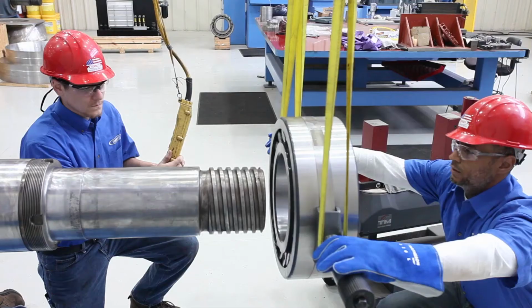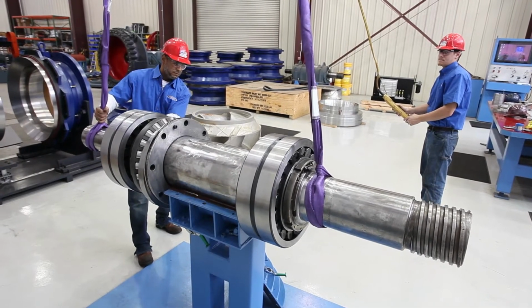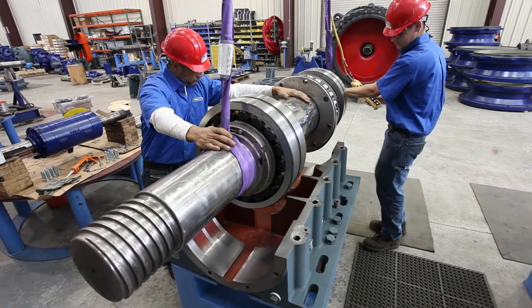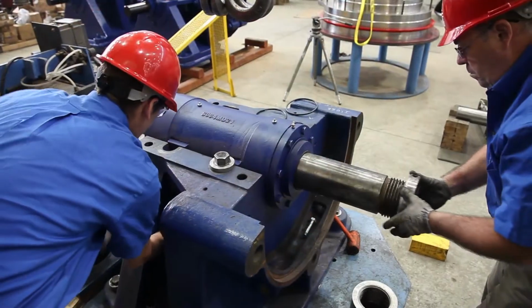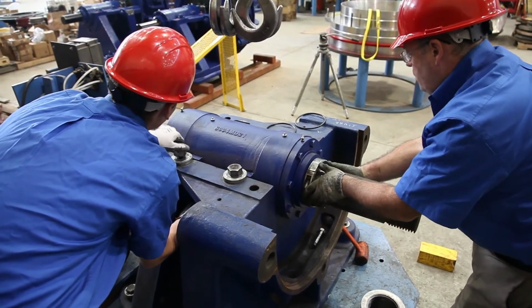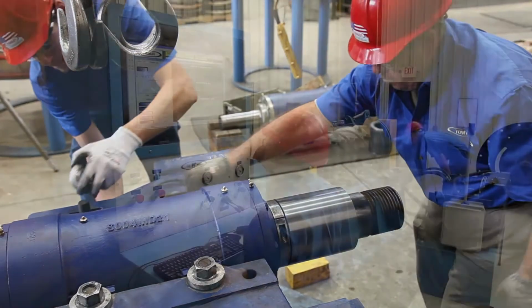After successfully developing the UBD wet end for use in phosphate mining, our customers realized that one of the weak links became the bearing assembly itself. Urs Blattmann was able to incorporate a new design. This new bearing assembly had a triple seal on each end of the cartridge and also incorporated a new impeller release collar. This enables our customers to be able to safely remove the impeller from the shaft.